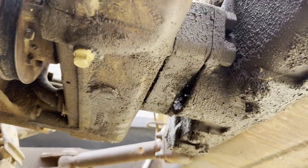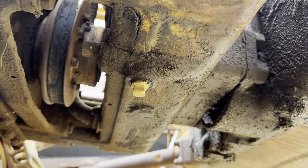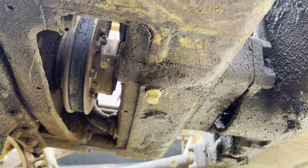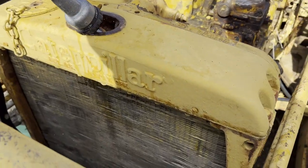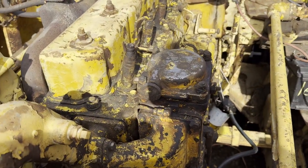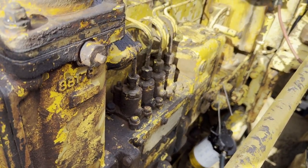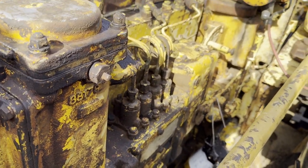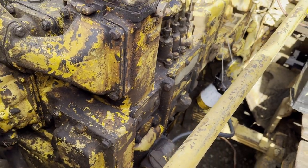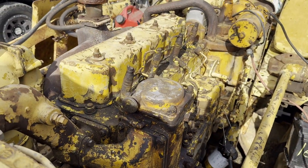Well, had I not come in here just to see if I could pinpoint the leak, I would never have seen that the drain plug was out. So let's fill that up again and hold thumbs that we in fact do not have a leak. Alright, I'm just filling it up with water, and gave this a power wash yesterday. I couldn't get the one pump there to bleed fuel, so I'm pretty sure that plunger is stuck, so we're going to tear into that soon and slowly work our way through the system, because I'm going to try and get the pony to fire up today.